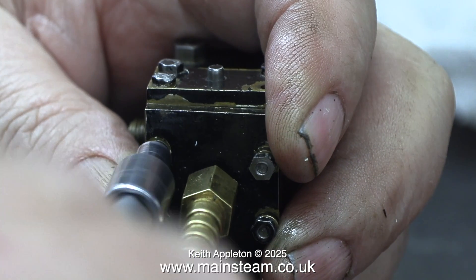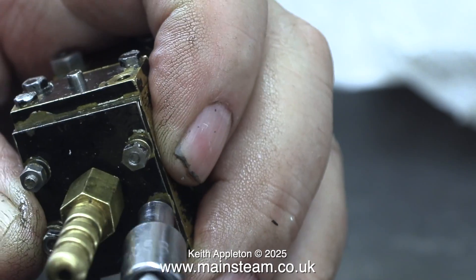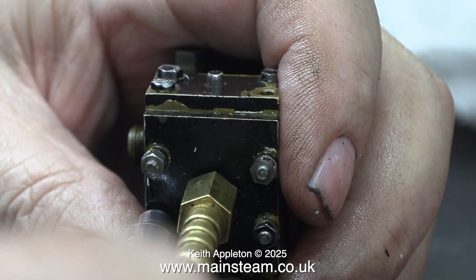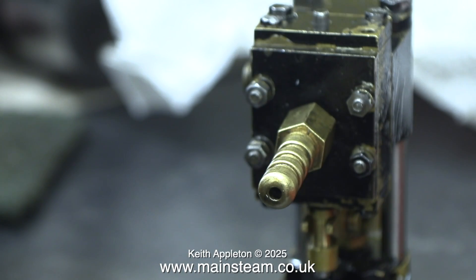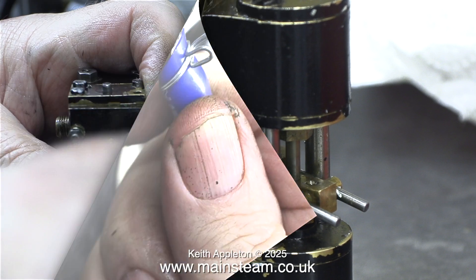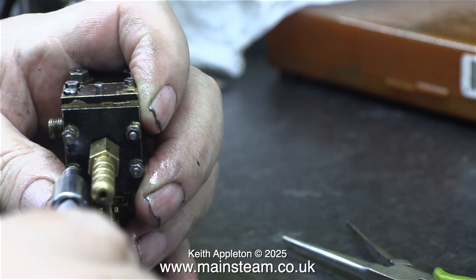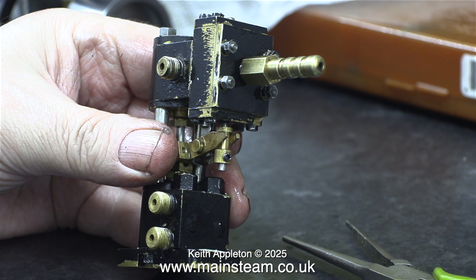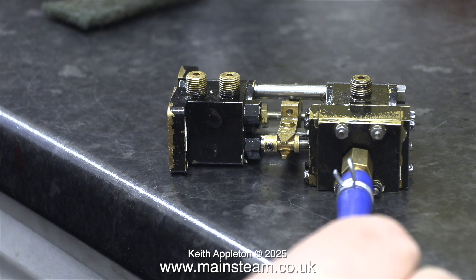Just for a change I'll refit the steam chest and see if it runs one more time. One of the top bolts is missing — this is intentional, it was not the right size and I removed it. I think it's been over-tightened because when I try a 7BA bolt in here it really is tight, which makes me think the thread is damaged. I will re-thread this hole in due course and fit a 7BA bolt with a smaller head. And once again the pump is trying to run but doesn't.